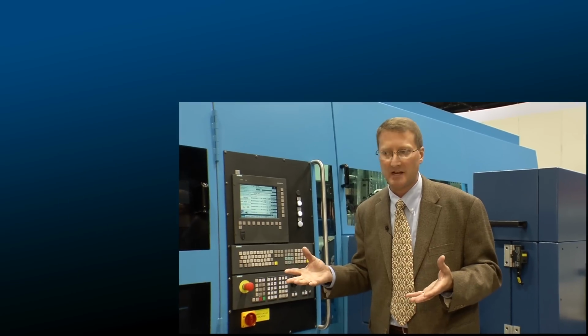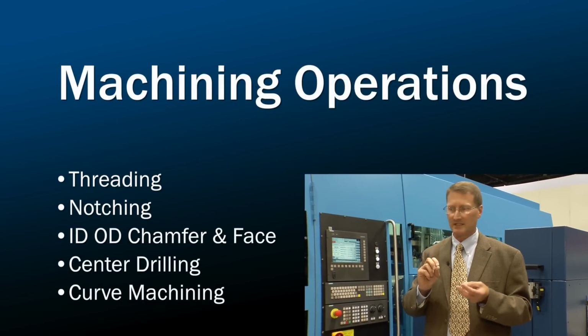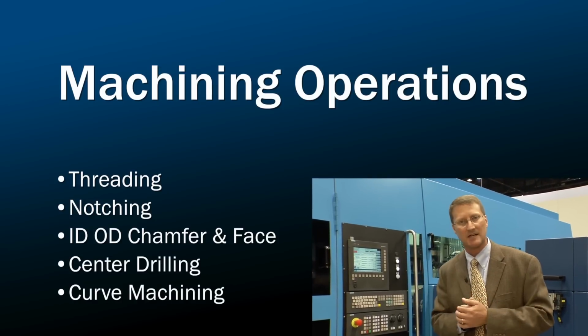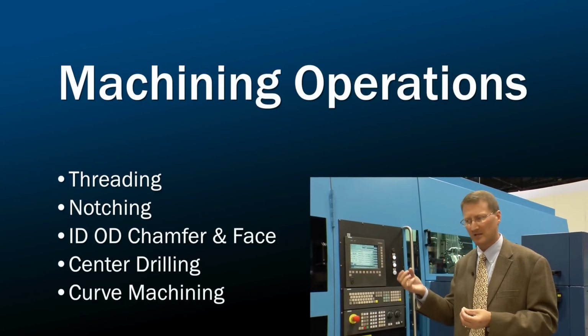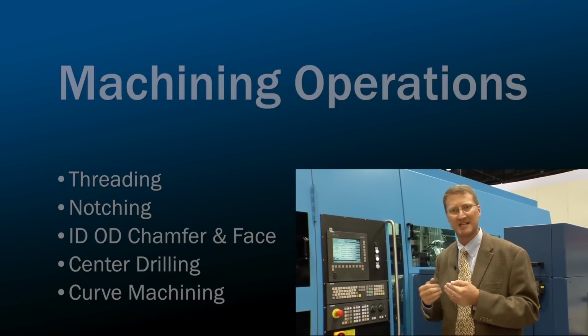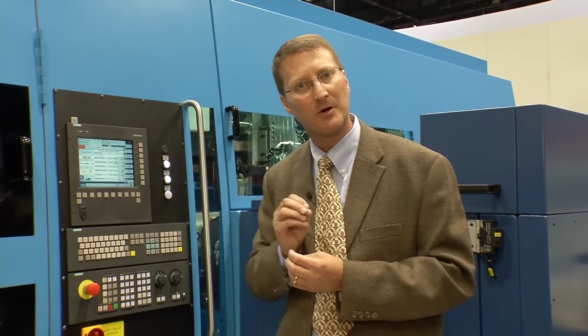The machining operation on the CFM Curve can be threading, it can be notching, it can be simple ID/OD chamfer and face. We can do center drilling on solid bar parts. We can do curve machining where we define very complicated paths on the outside of the tube and on the inside of the tube for things like O-ring retainers, circlip retainers, things like this. Very easy programming, no G-code required.